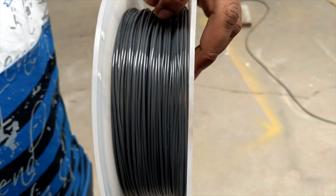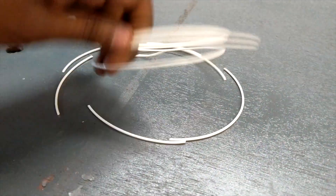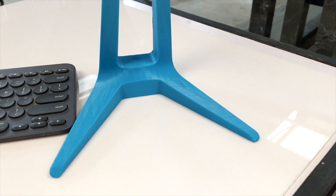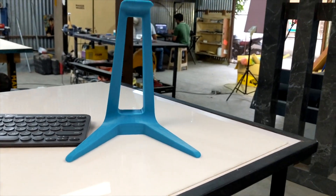The third point is the filaments we use. Make sure you buy from a reputed company — don't buy just because it's in bulk or cheap. The pellets from which filaments are manufactured should be virgin, and filaments should maintain a uniform thickness for smooth extrusion. With PLA, you may have seen them break overnight because the filament is old or has absorbed moisture. These filaments are from Solid Space, and ever since I changed to them they have been amazing — no stringings, even extrusion, and absolutely smooth surfaces. The melting point for PLA is around 200°C and for ABS around 230°C. The spools are also reusable and you can save up to Rs. 200 by buying spooless filaments and reloading.